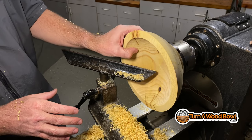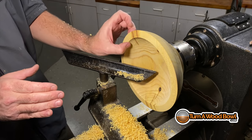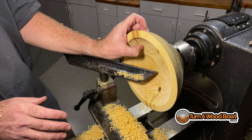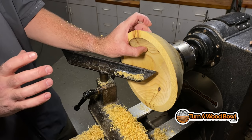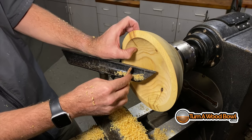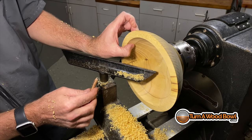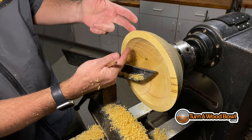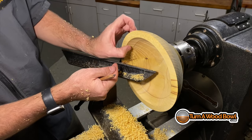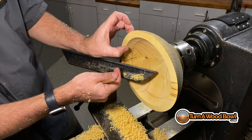Our fourth common mistake while turning the interior of the bowl is not paying attention to wall thickness. The easiest way to keep track of your wall thickness is to stop the lathe and use your fingers and thumb to feel that wall thickness. Your hands are super sensitive and you can detect where it's getting thicker or thinner. If you need to, come in and find a high spot and mark it with a pencil. Ideally, the bottom that you haven't worked yet is still thicker, so you have more material to remove. You don't want the reverse, where the wall is going from thick to thin down in here — so prevent that from happening before it occurs.